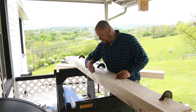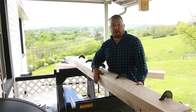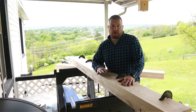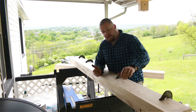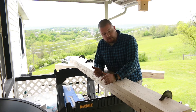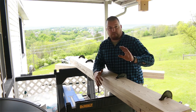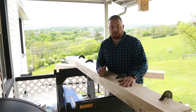If you find that you didn't get it very flush, or on the backside it's a little bit uneven, what you can do is take a hand plane or a power planer and just plane it off. I'm probably going to do that when this is done setting up and dried, so we have a perfectly flat surface that won't rock on us — dead flat — and then we can just place it up against our joists.